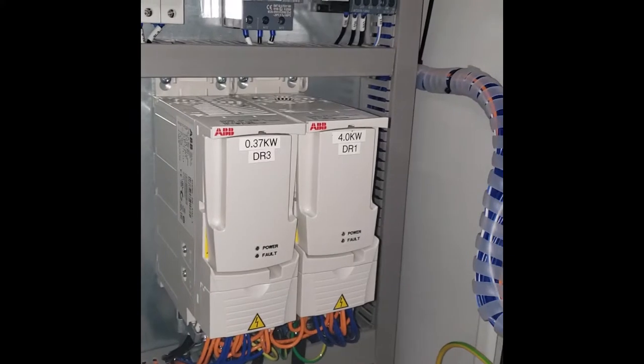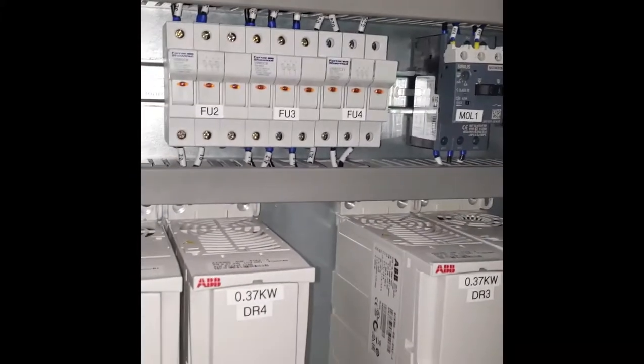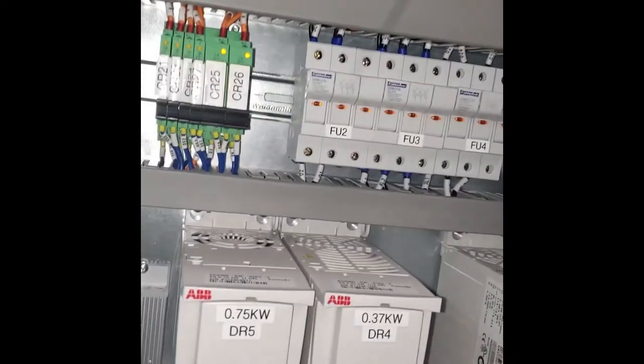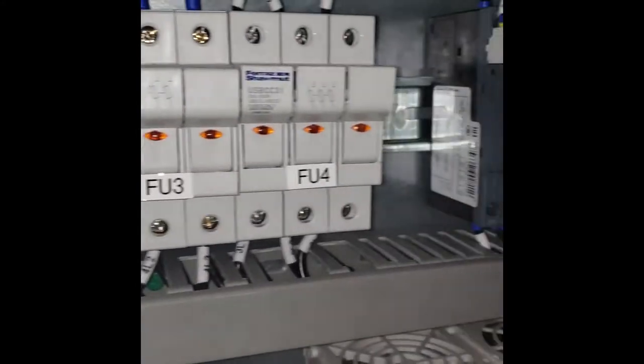We are going to check our voltage across our contacts and our leads. First, since we're doing our troubleshooting, let's check our voltage across our fuses. Fuses are the main things that go out in motor circuits, so if something's not running I recommend checking the fuse first. Right here, this is our fuses as you can see.